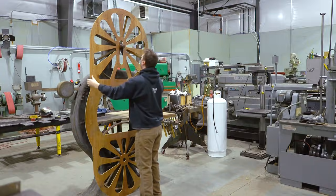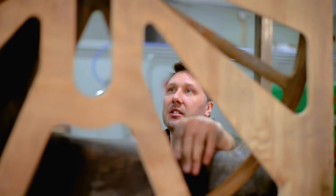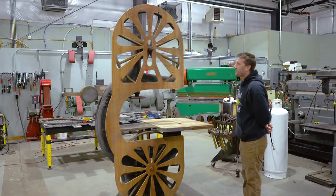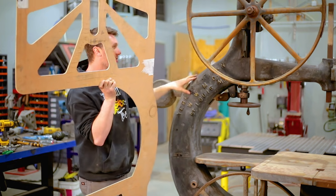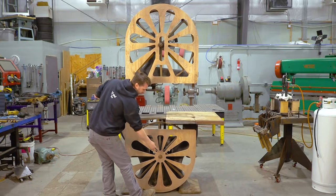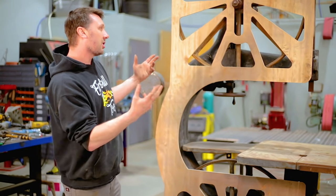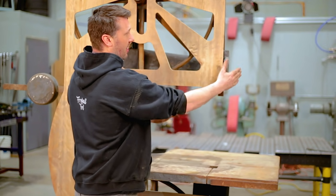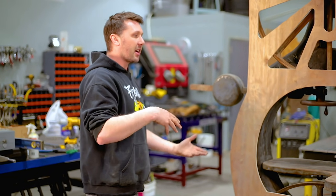I'm glad I built this template out of wood first because I've literally pondered over it for the last day or so debating if I like the look. A couple things come to mind: I didn't quite get the radius on the back of this arch quite right. I left some room to put hinges in here because the overall idea is that we'll be able to swing this guard out of the way to change the blade. I also didn't give myself enough clearance at the bottom around the holes, and I don't like this gap in here. But on CAD it always looks good, and now I'm actually able to see problems — like how wide this guard is going to be when we return the edge around so it clears the wheel. It's just a great idea to look at it before we cut it out of the expensive material.